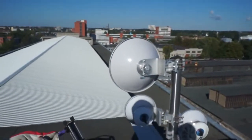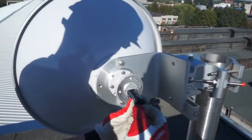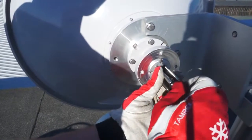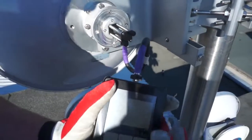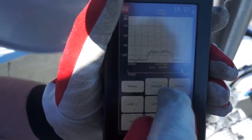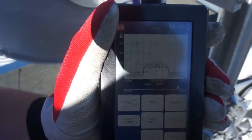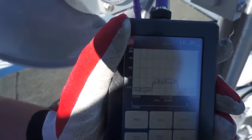So let's go ahead and go over to the antenna, which fortunately comes out of the box in vertical polarization. I'll attach this unit to the antenna. Now we need to do some basic configuration before we get started. I'll go to trace mode and use this feature called max hold. Max hold adds a blue line to the graph, which represents the strongest signal the Spectrum Compact has seen along the 100 megahertz span while doing an alignment.